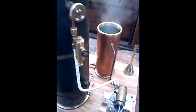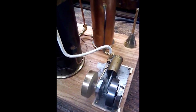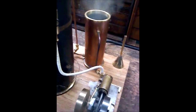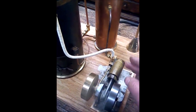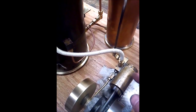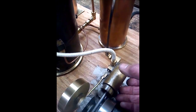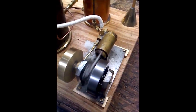There is a lot of condensation here because the engine really hasn't come up to temperature — it's only been running about eight minutes, so the casting is still cool. When the steam comes through it, it tends to cool down and condense into water. But when this entire unit gets up to temperature, there'll be a lot less water condensing. In a real steam engine, they put cladding around here — insulation that goes around the cylinder, and then usually little planking that looks kind of like a barrel — and that helps keep the temperature of the cylinder up, keeps the condensation down, and makes the steam a little more efficient.